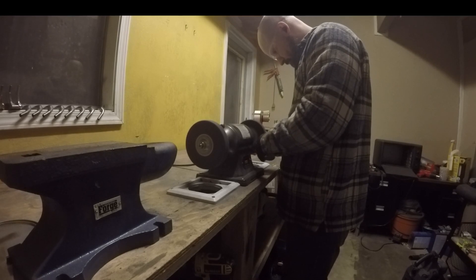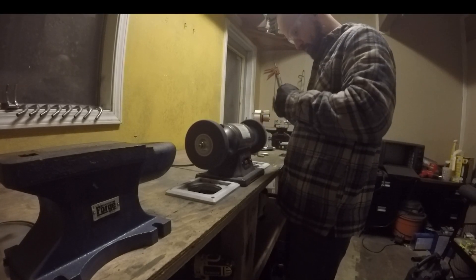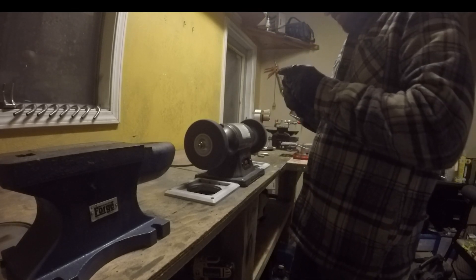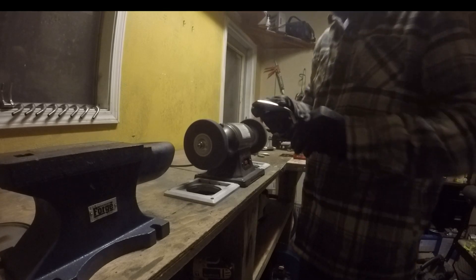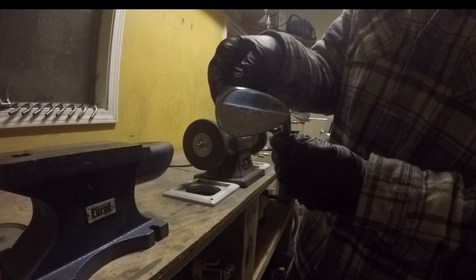If you're looking to do any custom work, I cannot stress how awesome this engraver is. With the engraving all done, we move on to the final step of polishing and light deburring to get the image we just engraved all cleaned up and ready for heat treatment. My wife wanted me to do an oil can torch finish on this particular wedge, so that's what we're going to do.